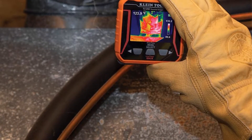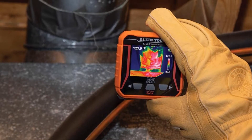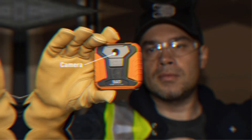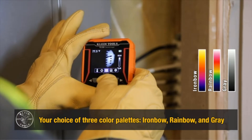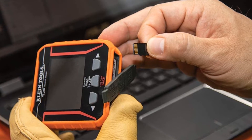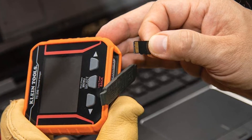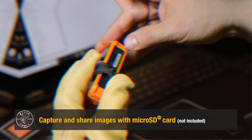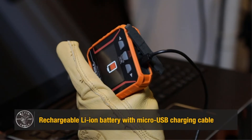The thermal imager has over 10,000 pixels to troubleshoot hot and cold spots. Adjustable emissivity from 0.10 to 0.99. Store and share images with an optional micro SD card. User-selectable high and low temperature alarms from minus 4 to 752 degrees Fahrenheit. Select color palettes to best capture the event. Pros: over 10K pixels, micro SD card slot, carrying case, temperature alarm option. Cons: slower than FLIR. Number 5.